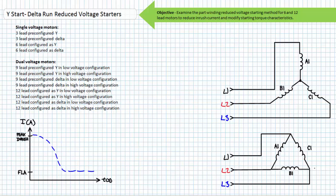As you are no doubt sick of me reminding you, the direct and instantaneous application of full voltage to a motor at standstill produces a tremendous surge of current known as inrush. Although brief, inrush can place an unnecessarily high demand on the electrical distribution network, and industries often pay a financial penalty for such events.